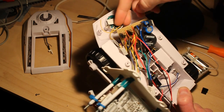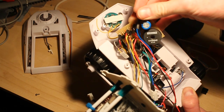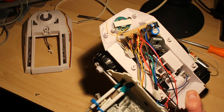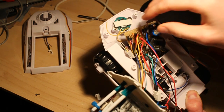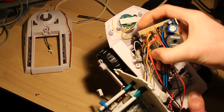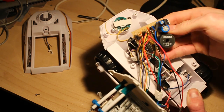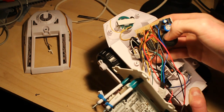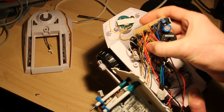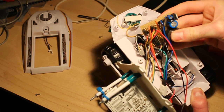These two circuits at the end here are the opto encoder translators. So they've just got a transistor switch which switches a logic level signal up and down, which is connected back into the interrupt pins on the chip kit. And in there, behind all the mass of wires, is an SN754410, which is L293D compliant quad half H or dual H bridge IC. I've put a couple of decoupling caps either side, just little 0.1 mic ceramics to smooth out the square waves.